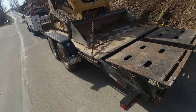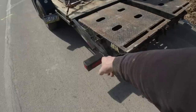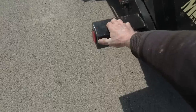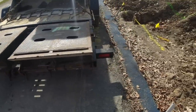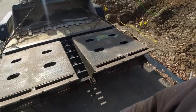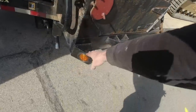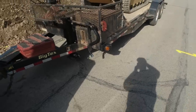I got stopped by the DOT the other day. These lights get hit and they were real chintzy tin, so I cut them off and I made new. I put quarter-inch tubing on there and put new lights on it. Somebody already stepped on my brand-new paint — I'll bet it was Steven. Same thing up here. These were all rotted off, so I made new corners and put some nice LED lights in there.